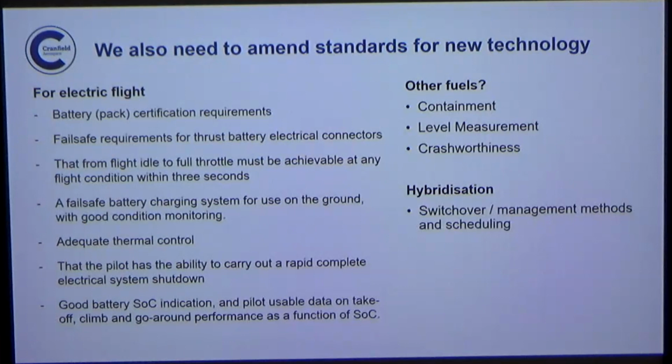Here's a fun one. You take an electric motor, bring your power back to zero, it stops. Then generally speaking, certainly with a big one, the current demand to unstick it to get it rotating again means that it takes quite a significant number of seconds to start rotating.